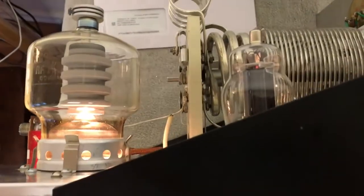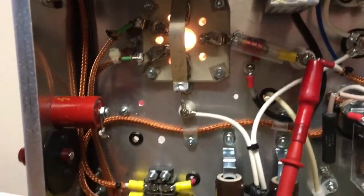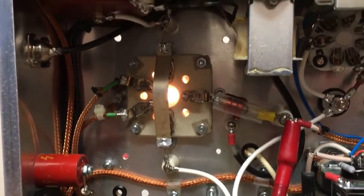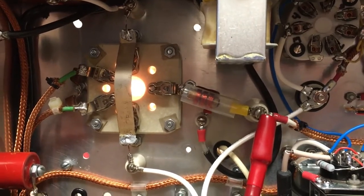I'll come up here and you can see both the tubes — right there they are. The big one is the 1625 clamp tube on the right side. I've got most everything wired up. I've got to add the voltage divider cap for the screen modulation, and it's going to go through that strap to ground. The center point of the divider will be the screen strap, which is perfect.